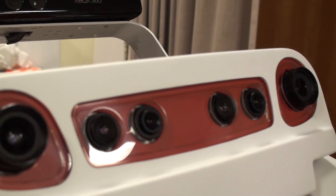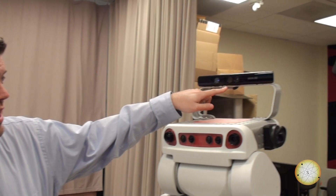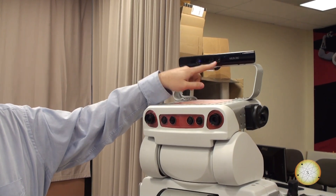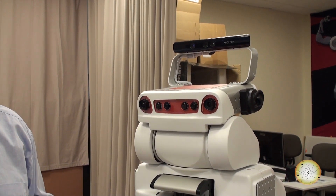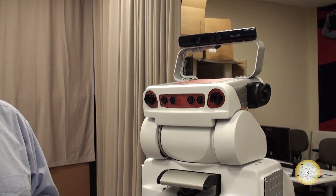We use this for color detection, so we can detect things with the onboard RGB camera. But we also do a lot of things with depth perception — figuring out the distances to objects. There's an infrared projector, which is this thing here, and there's an infrared camera that detects what the projector is spitting out into the environment. We can't see it, but the robot can, and it uses that to get depth.